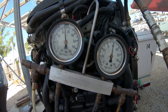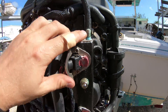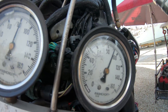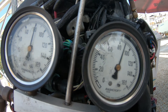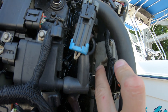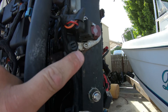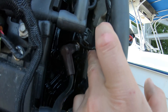If not, we'll move on to the pressure tests. This is the air pressure valve and here's the fuel pressure valve. We need to see both of these pressures at the same time to accurately diagnose the issue. We are looking for the fuel pressure to be at 90 psi and the air pressure to be at 80 psi. Some optis have a higher pressure at 110, but that 10 psi difference between the two is key. If the pressures are the same, then the tracker valve on the starboard rail is leaking and needs to be replaced. Remember that an OptiMax has a fuel injector that shoots the 90 psi fuel into the 80 psi air and through the air injector.